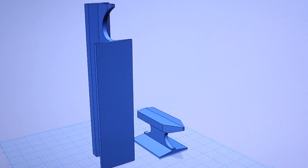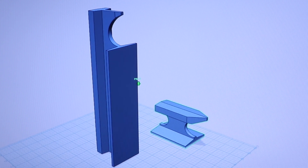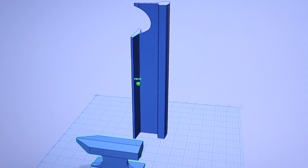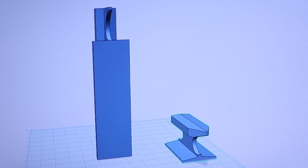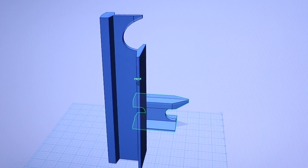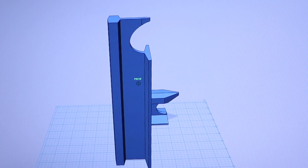If you see a length of railroad rail that's long enough, don't pass it up — they still make good anvils. You just need to stand them on end and use the whole length to give you the mass you need. If you search for makeshift anvils or shop-built anvils you'll find a lot of people have come up with innovative ideas on how to put railroad rails together into really good anvils. Because the rail has a complicated cross section, if you can't weld it to a heavy metal plate the best solution is to cast it into a block of concrete. The same holds true for a heavy section of square bar or flat bar — stand them up on end and use the whole weight of that piece as an anvil.